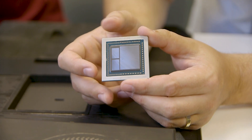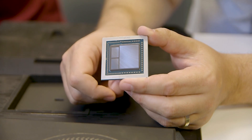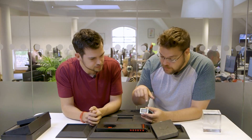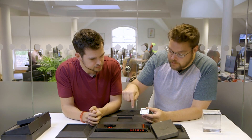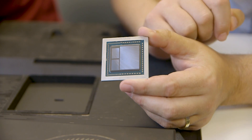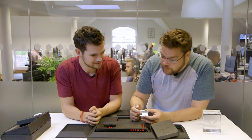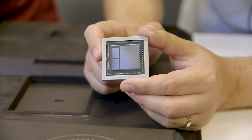What are we looking at here, exactly? On here you can actually see the high-bandwidth memory, because this is a different configuration to normal memory. Traditional graphics cards will have their frame buffer — their video memory — arrayed around the outside. But this is directly on the chip, which is what gives it the high performance. It also makes it a little bit more expensive. So those two little blobs are the high-bandwidth memory, and that's the AMD GPU itself.